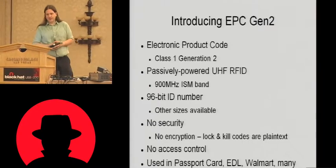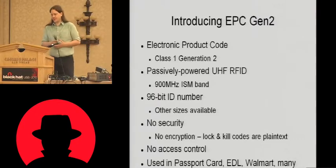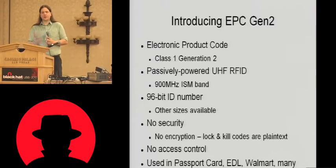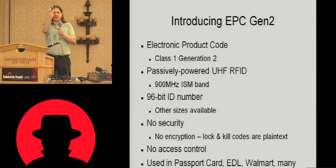So what is the RFID technology that I'm using here? It's called EPC Generation 2 — Electronic Product Code is the acronym. You can compare that to a Universal Product Code, which is a barcode. The tags are effectively electronic barcodes, or RFID barcodes rather. They're passively powered, they're UHF RFID, and they work at 900 megahertz. If you look at the pieces of paper that were handed out when you came in, you should see a metal strip in it — that's the antenna for the tag. Somewhere in the middle of that strip there should be a little tiny raised bump, which is the RFID chip itself.